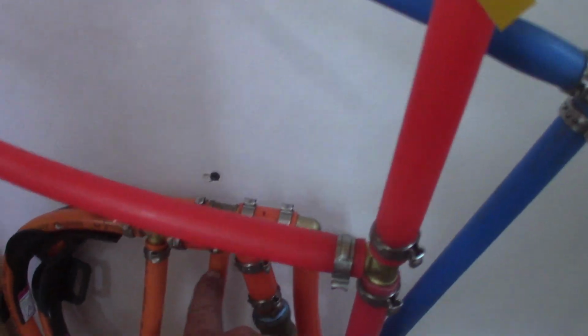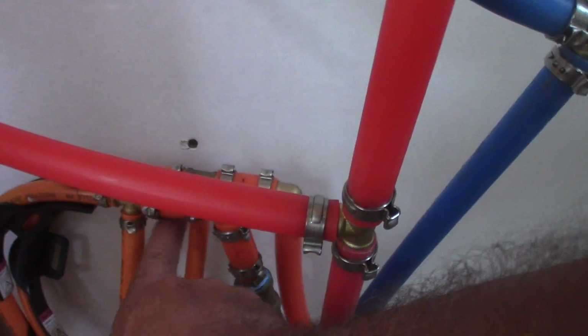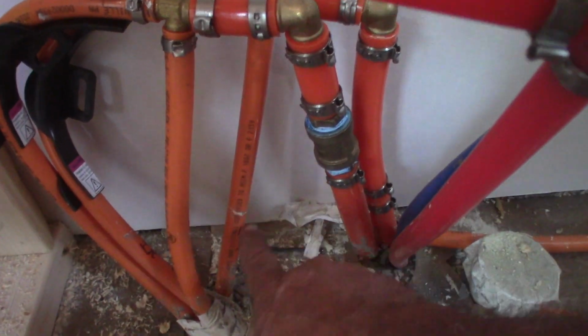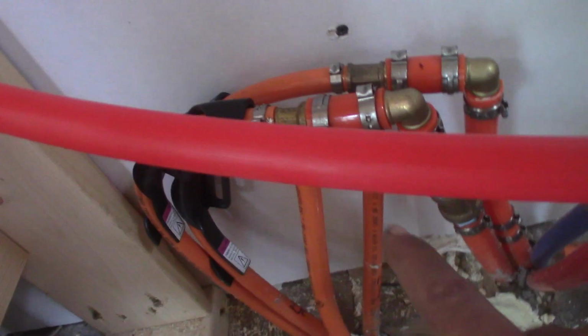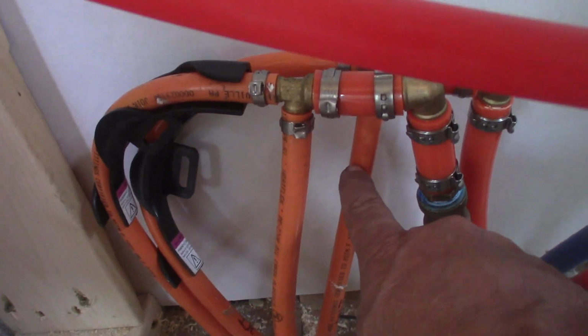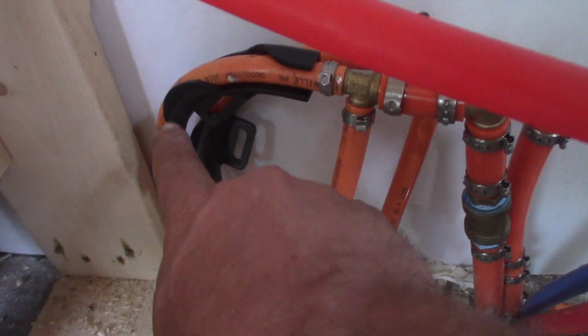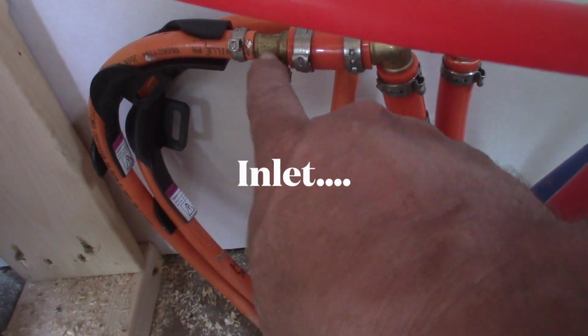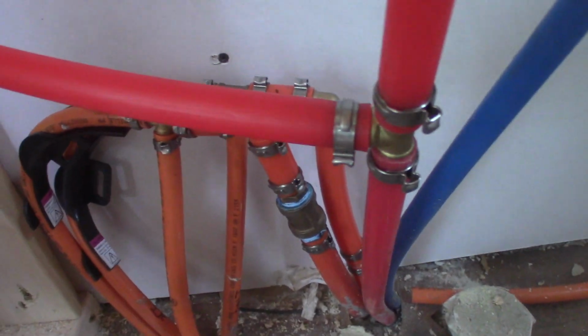It's gonna come from here, it shoots down into the one circuit, and this one shoots down into the other circuit. So this one shoots hot water down into the concrete floor. There's a T right here. You can just see it, that T right there, and that is the other circuit. There's two circuits in the system that will shoot water down that way. Now you're looking at it going, wait a minute, a whole bunch of it's just going to fly right past that. But on the way back, I made sure that this one here is the one that shoots in straight on the return, and the one that shoots straight on the inside winds up jamming into a T here. So I'm hoping that will balance out the flow.